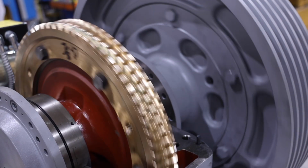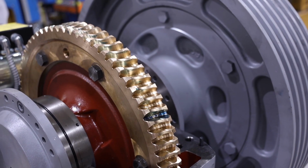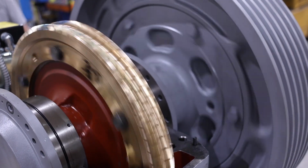It may also be beneficial to mark the location on the traction sheave that corresponds with the bluing on the gear to easily identify while rotating. Rotate the sheave both directions and stop the gear where the blue section is visible. Check the pattern against the factory pattern noted.